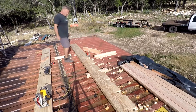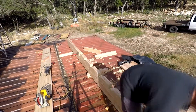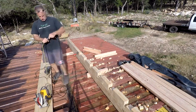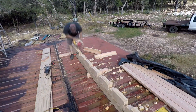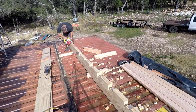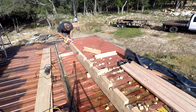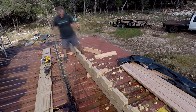Here you can see me clamping and redoing things — one of the rafters was a little bowed, so I had to reset and move it along, but no big deal, pretty straightforward. All these rafters get the kickout, and then the paneling goes on top of that, then the outside structure, and then the fascia. Should be pretty straightforward — fairly easy, just a little bit of work.